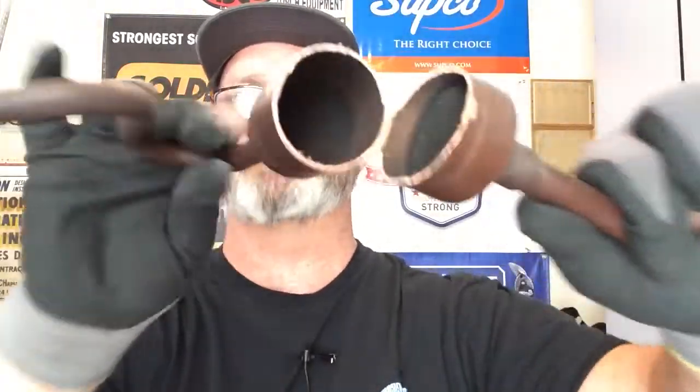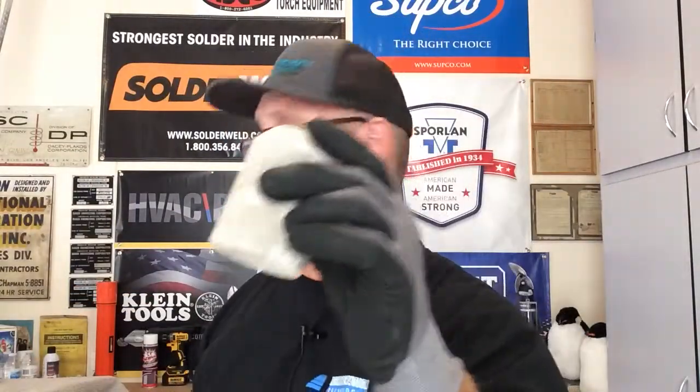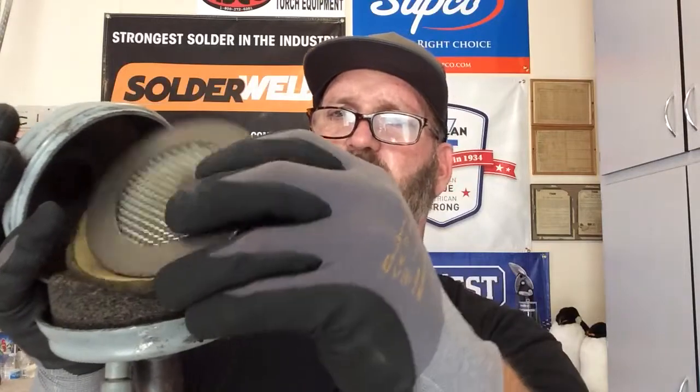You want to make sure you really look at what you're putting in. Make sure you're taking out a muffler and putting another muffler in its place - not a filter dryer - even though they look similar. I also have another dryer cut in half: a pancake dryer. Parker actually calls this a C146S TTHH. These are pancake dryers. You can look inside and see a washer, a ring, a screen, and the desiccant.